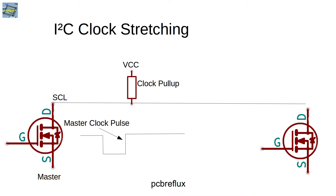Some words about I2C clock stretching: in normal mode the master can pull the clock line low, but for the high level the master doesn't have to pull it to VCC. The master only has to keep the line floating, and this is why the client can use clock stretching mode.